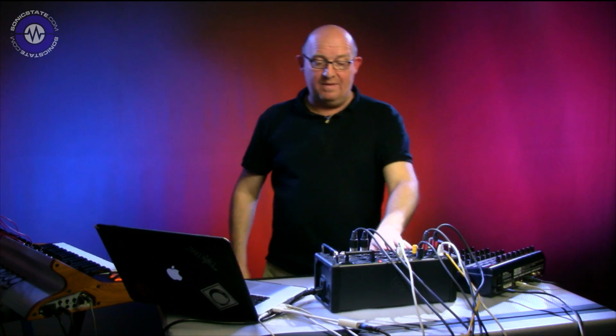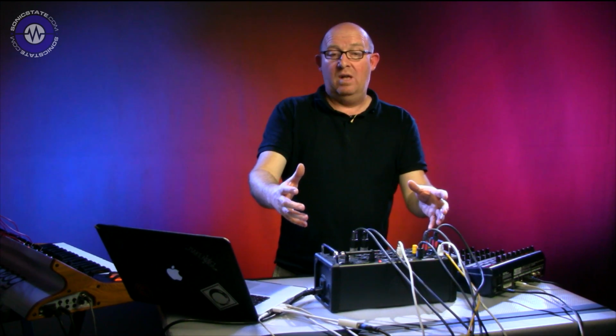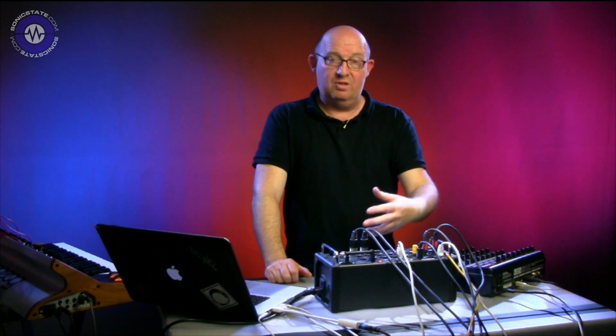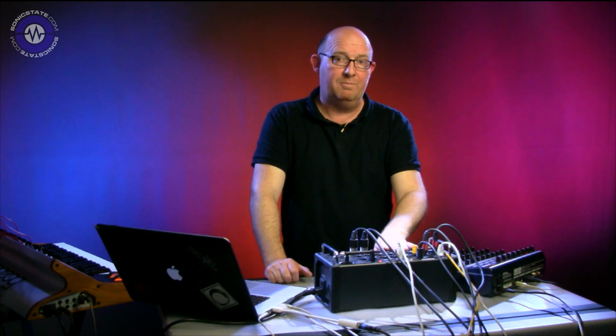The thing about the XR18 is, with the 18 I/O audio interface, it adds a whole lot of other possibilities into it as well. And so I can return channels, I can record channels, so I could use it for a variety of things. The previous models, or the models lower down the range, have less of a channel count, and they've also just got a USB slot that allows you to plug in a thumb drive or USB drive and record a stereo file that could be from the master or buses or whatever. There's a lot of routing potential.